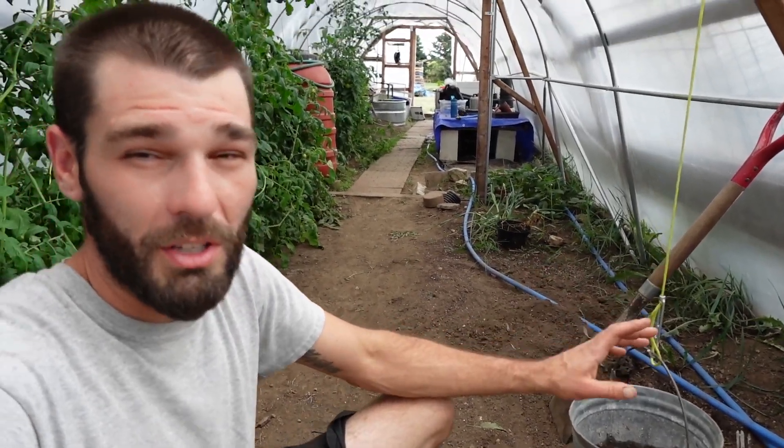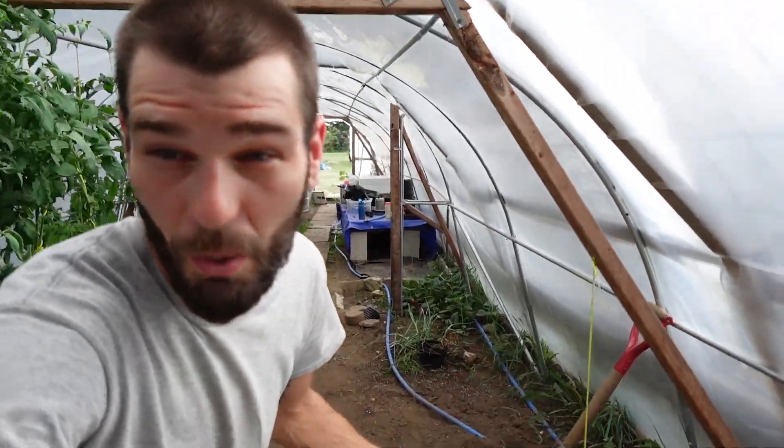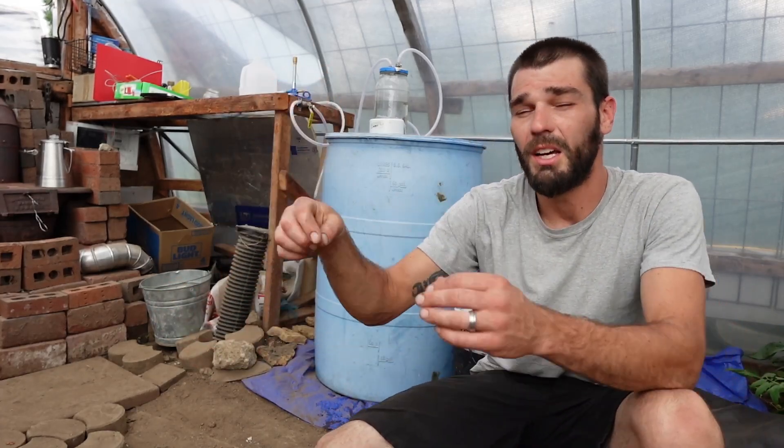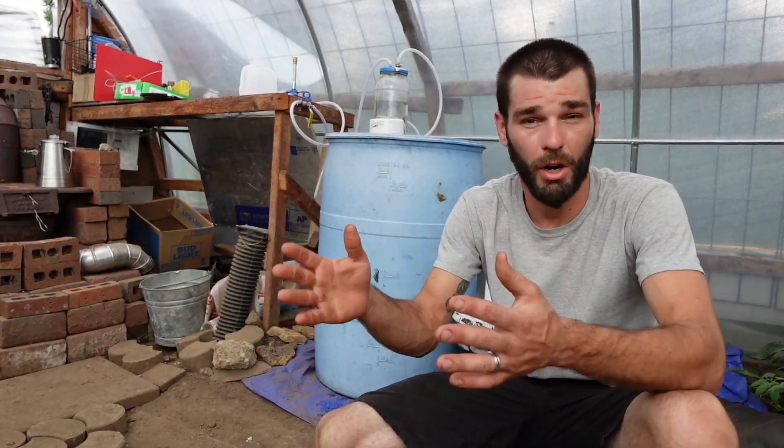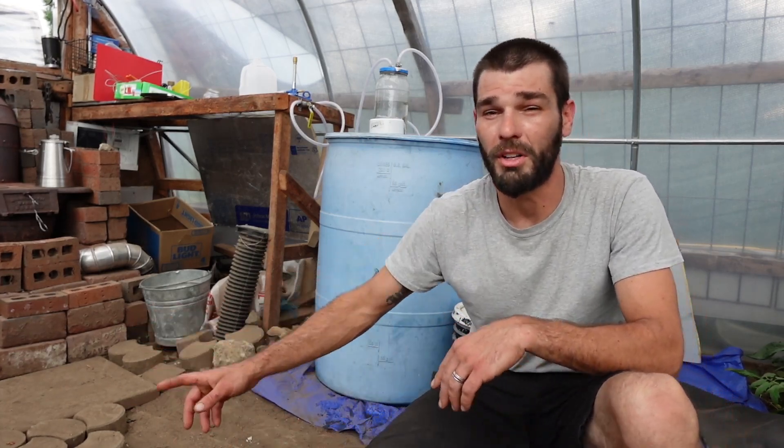That is dangerous water down there — we do not want to touch it. That is caustic lye water, and we're going to use it as a scrubber. On a large scale they use large towers that spray the chemical or cold water down over the methane, sulfurs, and carbon dioxide to scrub, clean, and purify it. All those terms are used interchangeably here. The alkaline solution drips through the system, pulls those negative compounds out, and all that runs off for some other industrial use.